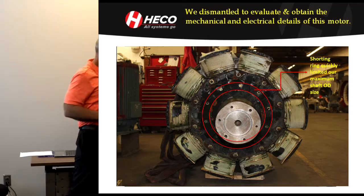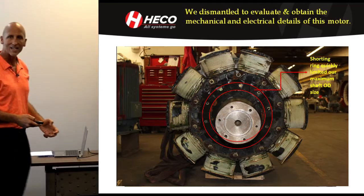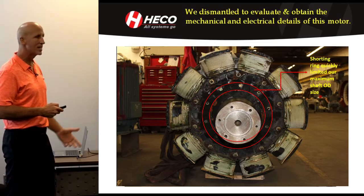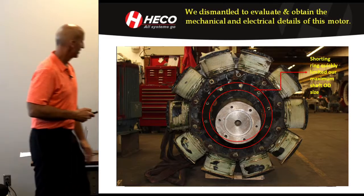They had a strap that went from here that was like the bars were welded to this copper plate. That strap went down to here and then was welded to a smaller ID shorting ring that then was bolted to the face of the Spider. So a unique design. So not this style, this style.